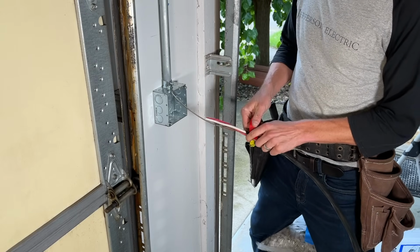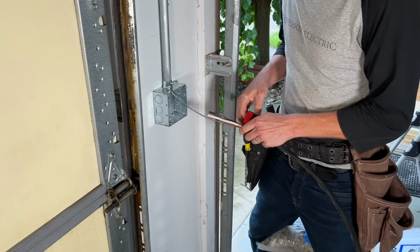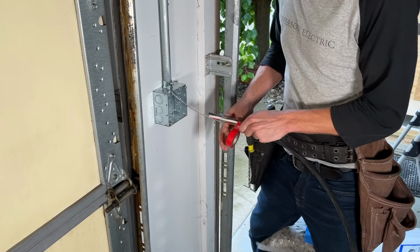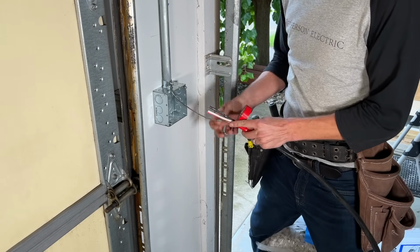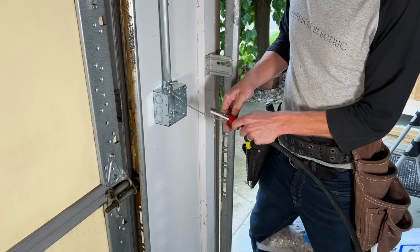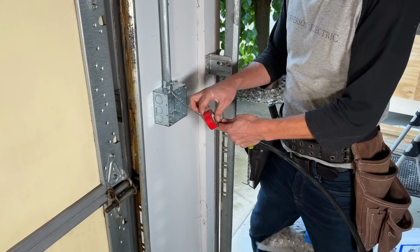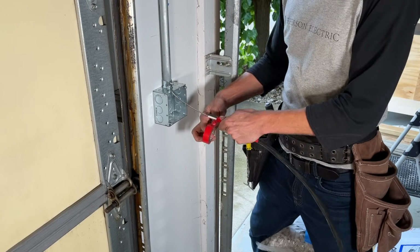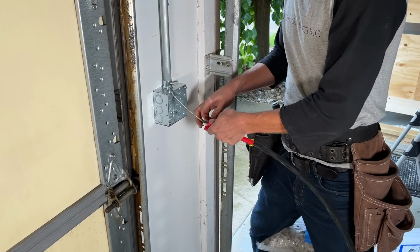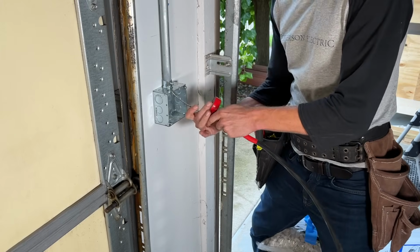I could also lube the wire. There's a dedicated electrical compound for that so that the wire insulation and integrity is not damaged. But in this case, I'm really not concerned about that. The conduit is properly sized. That's 3/4 inch EMT for the 6/3 Romex. No concerns there. I am using decent electrical tape. This is Scotch 88, it's real good. And I'm pulling it tight. Can't use really too much.